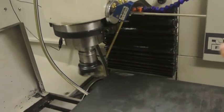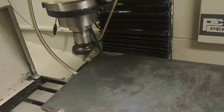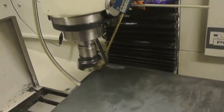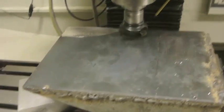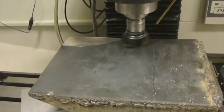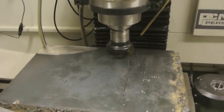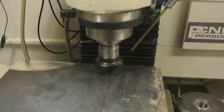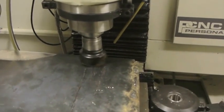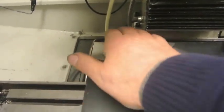So here we are on the second cut. It's just cutting in that far corner as you can see, and it's quite noisy. I'm not cutting over here. I might have to dress that far edge off with a file because I'm right on the limit of the Y axis to get the full width in with the cutter. I might have to move this a little further over, but I'm not too concerned - it's very little. There's a lot of distortion where the plate was guillotined, so it's probably OK.